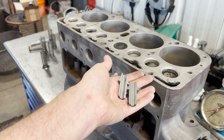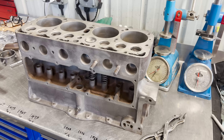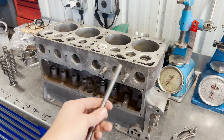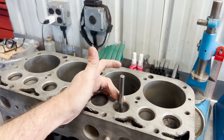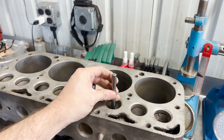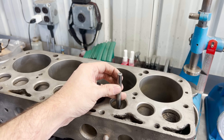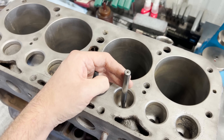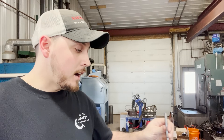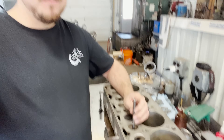All of the tooling that we use to cut valve seats is guided by a valve guide pilot that goes down inside the guide — your tooling rides on top of this pilot. The pilot actually spins in the guide, so there has to be a little bit of clearance. But the more clearance you have, the sloppier your machine work gets. These two-piece valve guides actually induce a problem for getting a quality valve seat cut.